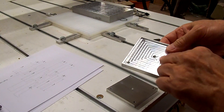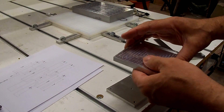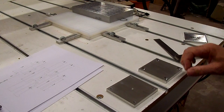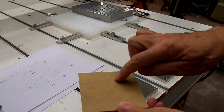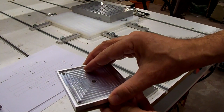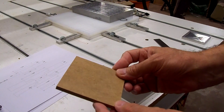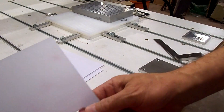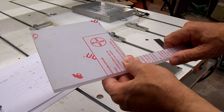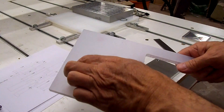In order to machine the recesses — particularly the hole going through here — I need to make a special vacuum plate to go between this plate and the fixture, or I'll lose suction with the hole in the center. I was going to use a piece of MDF and make a groove for gasket and a groove around the perimeter to seal it, with some holes for suction. But with the MDF I'm afraid I'll lose too much suction. So I think I'll use this piece of Lexan or plexiglass — what I used to make the dust hood for the router — and make this special plate.